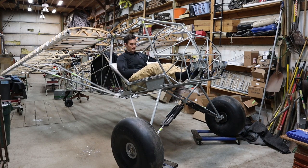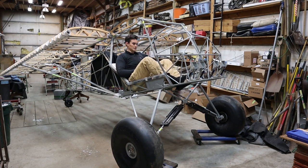I did end up taking some of the bearings out of the rudder pedals to try and reduce some of the resistance and it didn't help at all. There's a little resistance on the far throw — it doesn't overcome the spring tension, so I'm not really sure what else to do. We've sanded everything down as much as we can and I think I might just have standards that are too high, but we've done everything we can to get them to move.